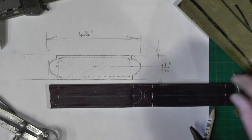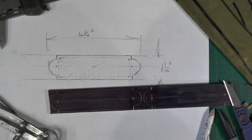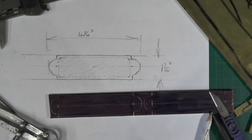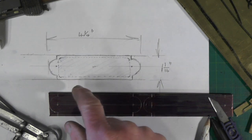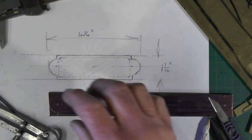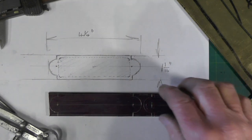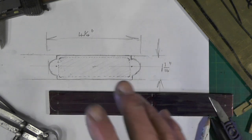I've been rooting around my brass offcuts and I've found this piece of one-eighth brass and various other bits — a sixteenth brass — which are just here. Now this is not my idea, so I'm not going to take any credit for this. My tutor when I was an apprentice, many many moons ago — he's in his nineties now, Brian — I can remember him saying this is how he did his. He didn't go into any great detail but he said he'd cut the letters out and soldered them onto a base plate, and then it looks like a casting, because these castings are quite expensive if you haven't made them. And you know me by now — I don't think I'll be spending any money on nameplates if I can help it anyway.